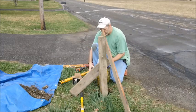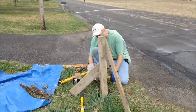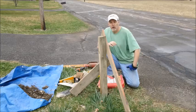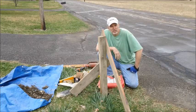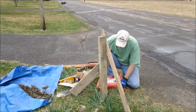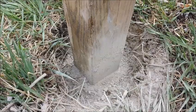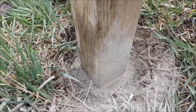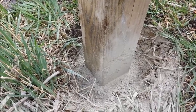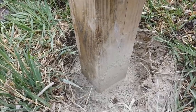I just go ahead and put a little more gravel in the hole. After you have the gravel around the hole, go ahead and put in some post setting concrete — just put it in dry. You want to fill up your concrete until it's about three or four inches from the ground level, because we're going to backfill with regular soil.